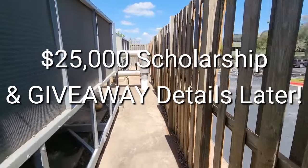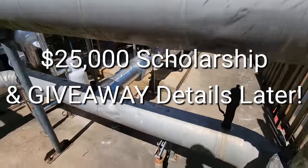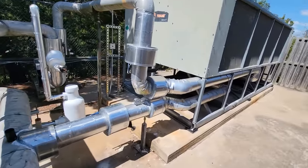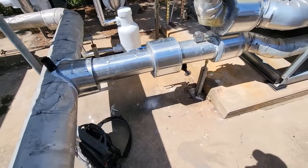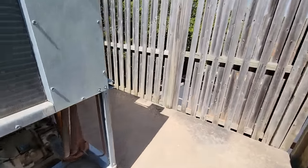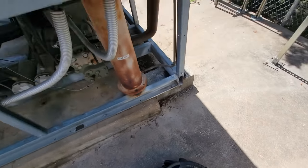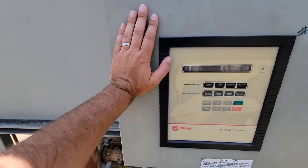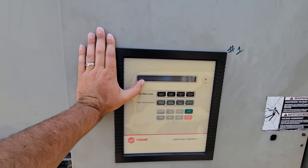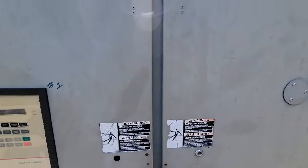We've got this air-cooled RTAA — the EXV on circuit one is having trouble. We actually did end up replacing this EXV several months ago and it hasn't given us any trouble, but this morning he came to check on it and yeah, EXV electric drive circuit one — we need to see what's going on there.